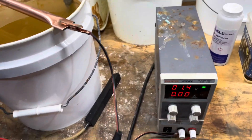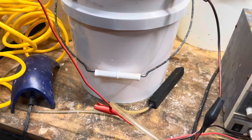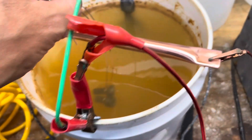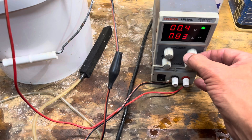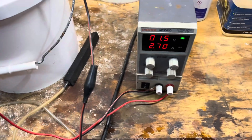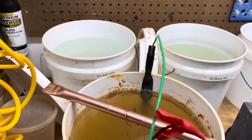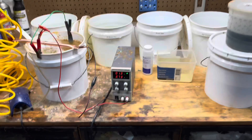This is my power supply. Look what my pieces look like when they come out of the muriatic acid — about half acid, half water. I keep a little container outside in the driveway away from everything. I hang them on this copper wire inside the plating solution. The voltage is really important — I usually like to keep it at about 1.4 volts. This is from an aquarium — I put that in there because we have to have good water circulation or the plating doesn't look good. I've got a little pump that provides the water circulation.